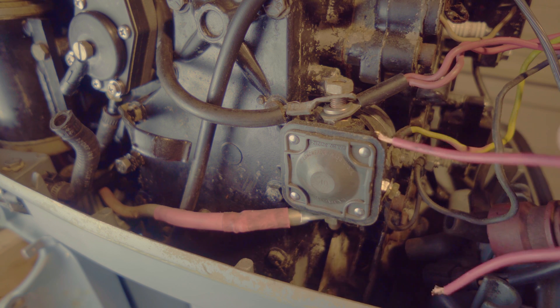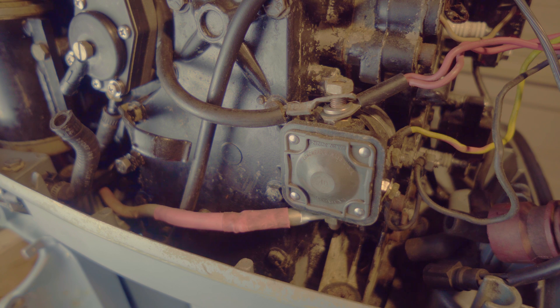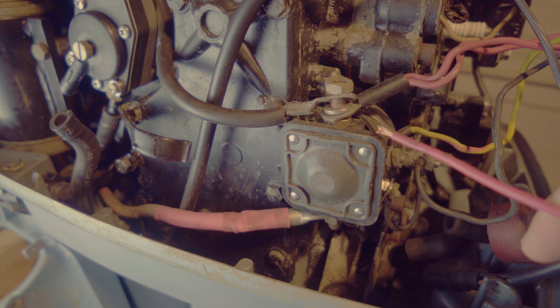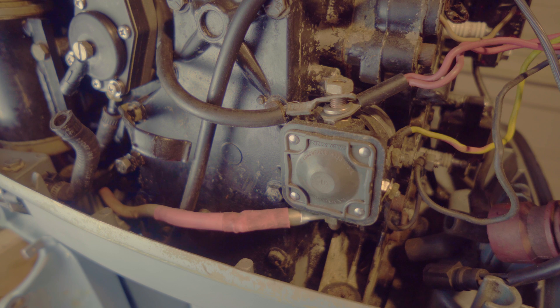So you can have either the solenoid breaking, or most likely what happens is one of these contacts gets bad or simply falls off. This wiring in boats gets very rusty very easily, and this can just make you have a bad day out on the water for literally one tiny cable. If your motor doesn't start and you're sitting out there in the water, just see what's going on first — is there any click, do you hear any sound when you turn the key, or does nothing happen at all? If nothing is happening whatsoever, it is probably that the solenoid is not getting any power or it's dead. Just troubleshoot it this way and a long tow back to shore could be fixed in 30 seconds.